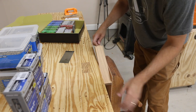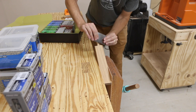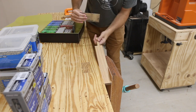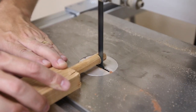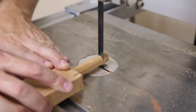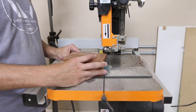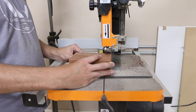When I took it off the lathe, the tenon was still just a little bit too large to fit into the mortise I had drilled, so I used my card scraper to bring it down to the size I needed. I also made sure the tenon was longer than necessary, so here I'm trimming it off at the bandsaw so the tenon doesn't bottom out into the mortise.